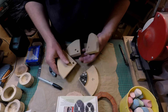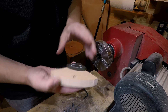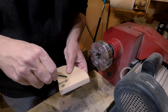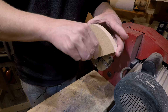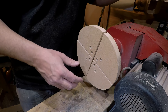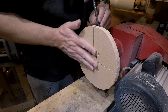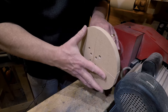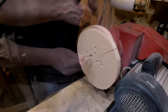All the jaws are now attached to the face plates and can be fixed to the chuck. If my holes are lined up properly, they should fit on nicely — it's easier to drop the bolts in the holes first rather than feeding them through afterwards. Making sure jaw one goes onto jaw slot one, I get them all on loosely. I then tighten the jaws using a longer chuck key, with the jaw plates all touching, and tighten everything up. That's how easy it is to fit the jaws.